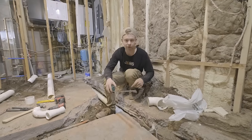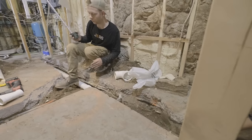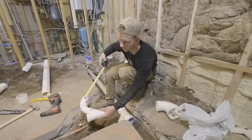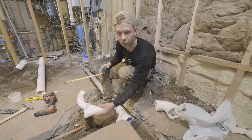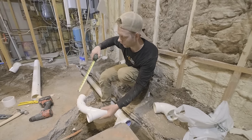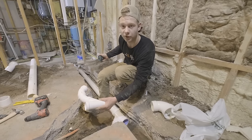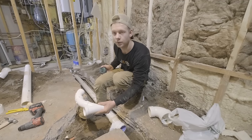Out of the end of this three-inch pipe we're running to the toilet, but we've branched off with a three-by-two Y and then we're installing this turnaround fitting. The reason is so that we can get within five feet to that shower, because that's the maximum trap arm length. We added more fittings to turn around and head back for the lav — we'll be backtracking a little bit. Since we're doing two turns and have two sinks with a fixture cross, we'll be putting a clean out on there so that if there's ever a blockage it can be cleaned out.